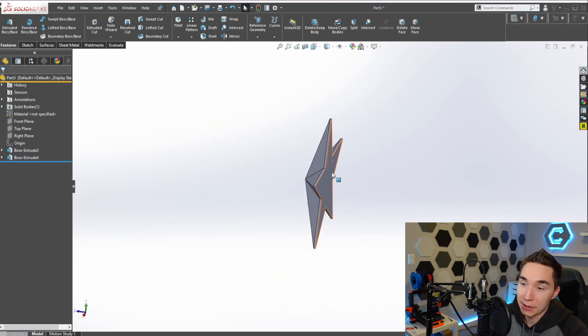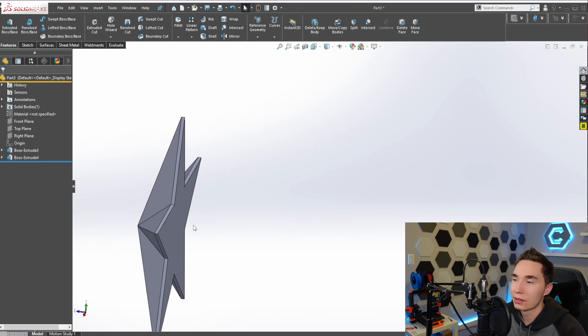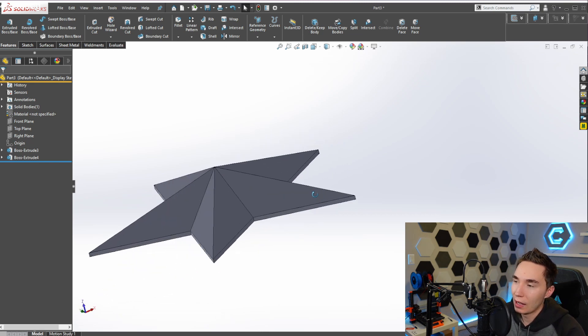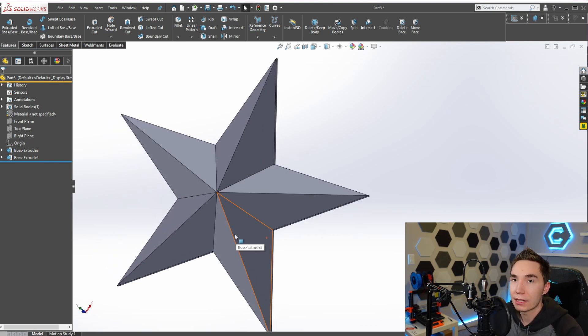This is pretty simple - it just takes two of these to make the ornament, back and forth. The way I'm going to connect them together is to make some alignment holes and put in little wooden dowels. I got a lot of hate mail - people really don't like me using wooden dowels to put plastic parts together - but I like it mostly because you could do a locating feature, but then I'd have two different parts to manage. This way I can just slap two of these onto a 3D printer for the whole print. Also, if anything is sticking out on the bottom you'd have to raise it off the bed, whereas this I can just 3D print flat on the bottom, make the cavities, and pop the dowels in.